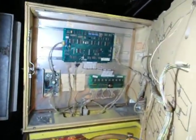But what I can do, and what I've done in the past, I had some other light problems in the past. I forget exactly what was going on, but it wasn't those four. What I ended up doing was removing the MPU and bringing it face down. There's enough room to do that. And I applied a little solder on the fingers on the other side of this connector. I don't have the light in here now, but on the other side of this connector, you have your fingers. And I applied solder. It was a pain in the butt. The solder was hard to stick, but I applied solder to it, and it corrected the issue. So this is new. This has just come back.